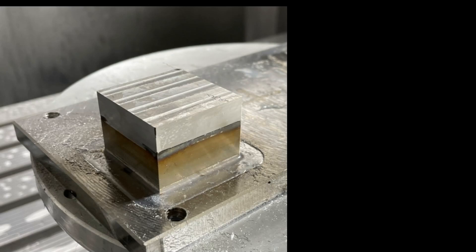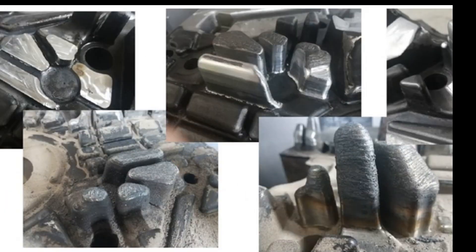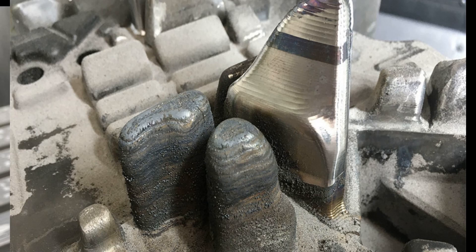This is very beginning and basic mold repairing. In real mold repairing — for example, the die-casting mold of the auto industry — it has very complicated geometry, and the problem happens: cracking or wear occurs deep inside. The milling head and laser head cannot reach the deep place, so we cannot make this part in one operation. The complete geometry should be divided into two, three, or four pieces. We must make partial laser cladding and partial milling, then continue with partial laser cladding and partial milling again. This job should be repeated three or four times, and finally we will reach the complete geometry of the target volume.